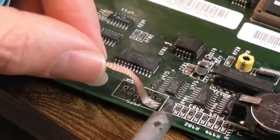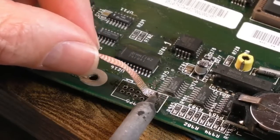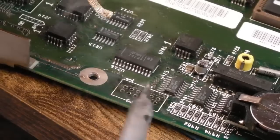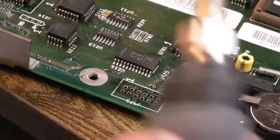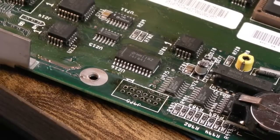And it's a two-fold thing. You're not just tinning when you do this. You're getting a bit of friction. Any little bits of corrosion that remain, with a forwards-backwards motion, you will help remove the corrosion, you know, the corroded oxidized trace.